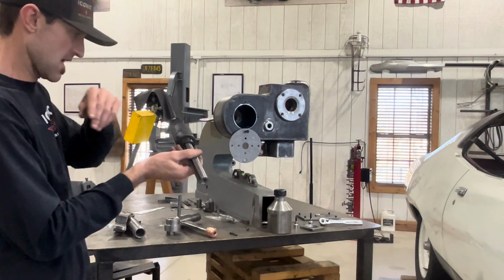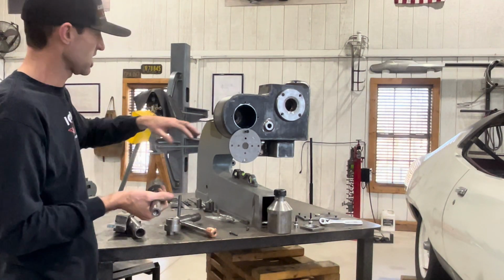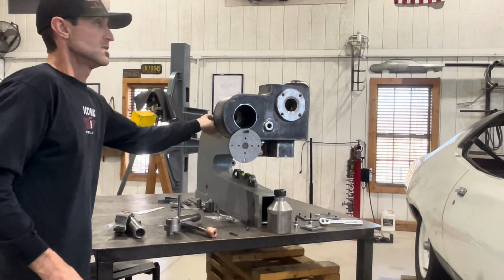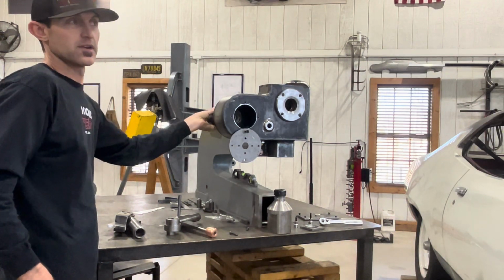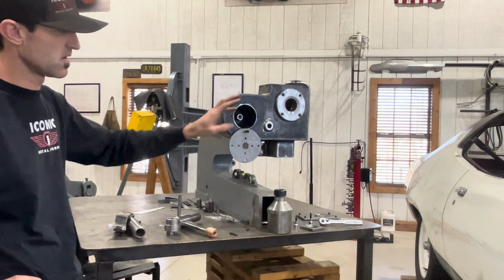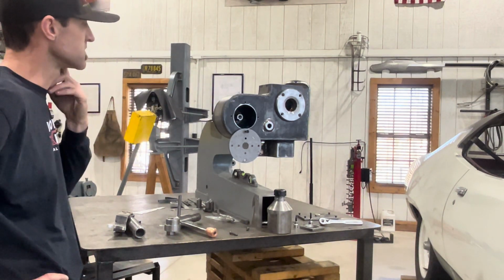So this is my shaft. It's a 1-inch shaft to be driven with a 5/8 shaft motor, which will be roughly 1725 RPM. I am going to put it on a VFD drive so I can control the speed as well.